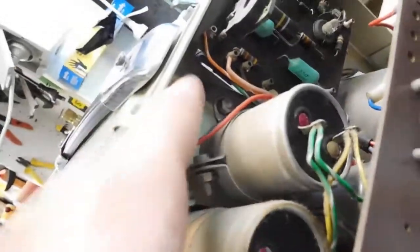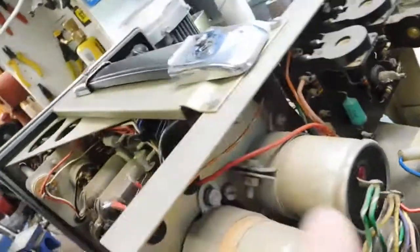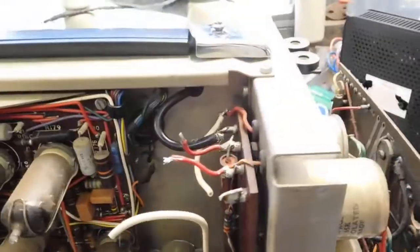It appears that these two up here are actually feeding it. I'm not sure where that one's coming from — maybe off that resistor. It's that one on this red wire here going into this little board. That long brownish cylinder there will be a diode, and that's your output going to your cap on the CRT. So it's pretty straightforward, but working out what I could replace this with — whether I could even make up a little driver or something — is the question.